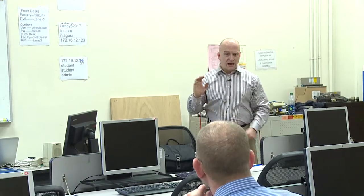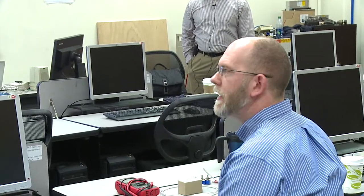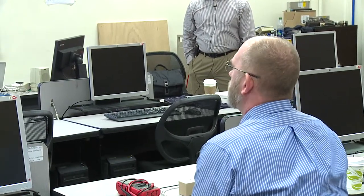How many know what a live zero means? You do. Can you explain it real quick to the group? So the best way I always have of describing it is a live zero. If you cut a wire and it's not a live zero signal, you don't know the wire's cut. Zero is zero.